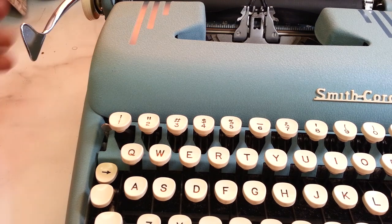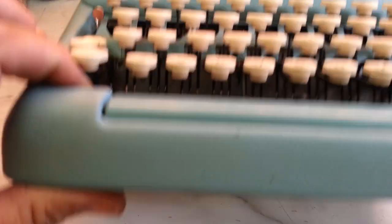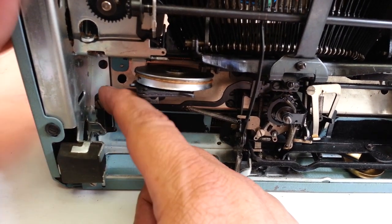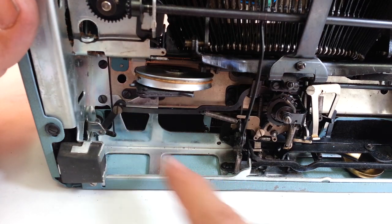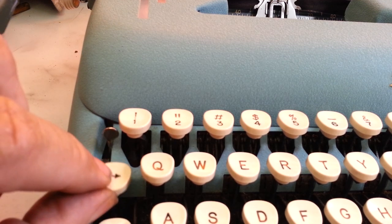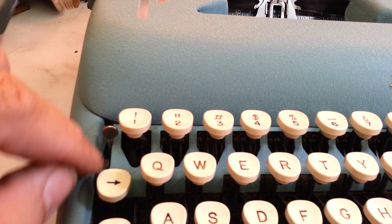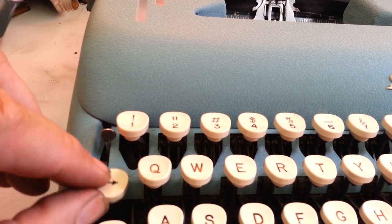It's not grinding like it was before, but this should not be sticking. The lever here is free but sticking — it moves this arm right here. Let me move it back manually, there we go. One way to find out what part is sticking is to do a little pre-analysis and see that when this pushes down, this part is not sticking. This is free — it's not in this part right here or even in the linkage that goes back into the back. That's free.